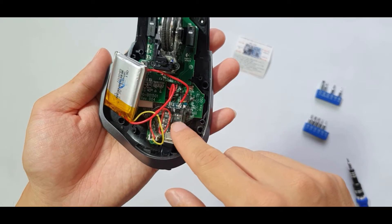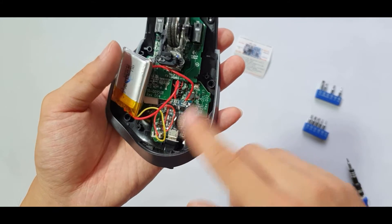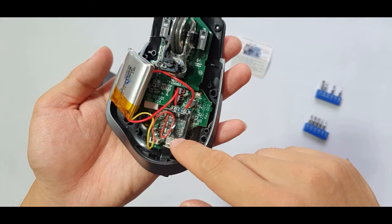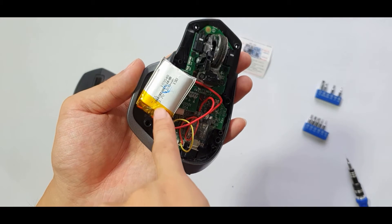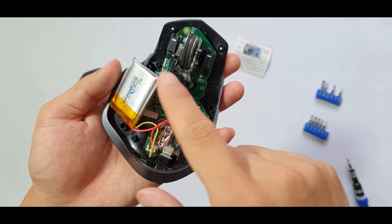The wiring is very simple — you just have to find space to fit the board. I wrapped it in tape to avoid short-circuiting anything inside the mouse. Power comes in through the micro-B or through the Type-C adapted to micro-B, and then B-plus and B-minus simply connect to the battery's plus and minus terminals.